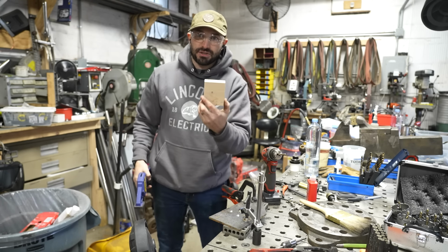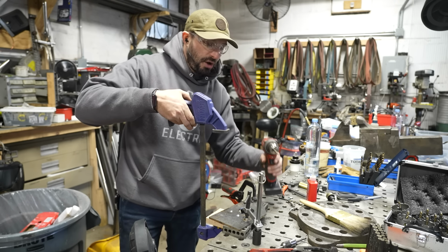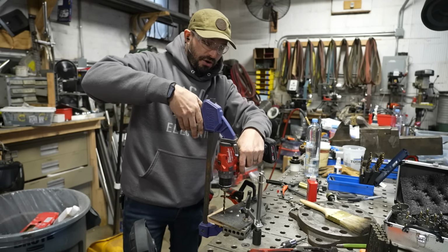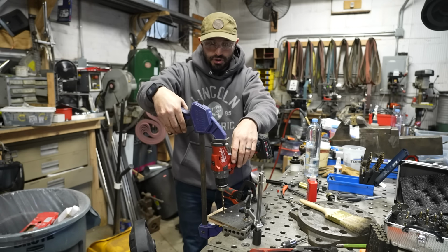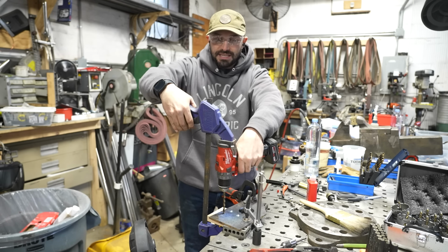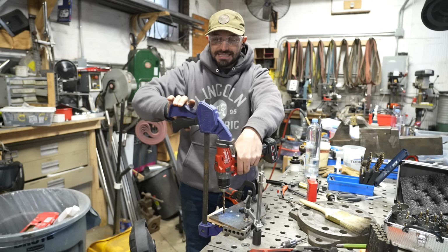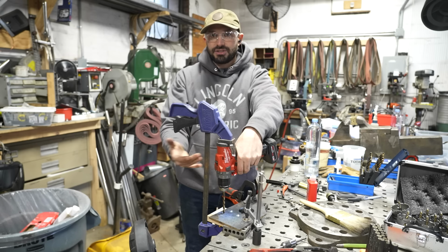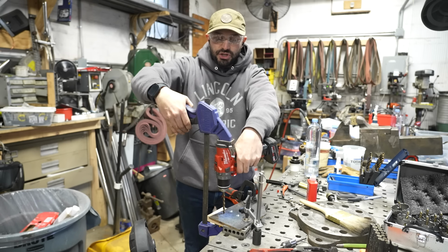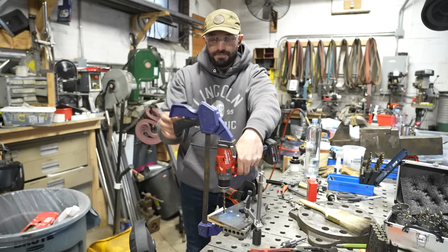Now you're going to want a piece of wood as a backer, but essentially what we're going to do here is create a clamping scenario where your drill is being clamped by this squeezy clamp, the trigger clamp, in order to create downward pressure without you actually having to lean over it. So you can kind of get where I'm going here. So now I'm squeezing the trigger and I'm squeezing the clamp, and it's starting to drill that hole. Now, it's not ideal and perfect because the clamp only has so large of a throat, but I'm standing in the same place I was standing before, and if I squeeze the trigger and I start working in on this clamp a little bit at a time, I'm going to be able to drill the hole.